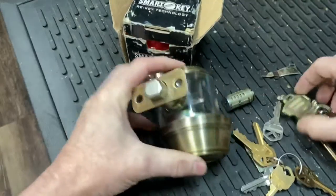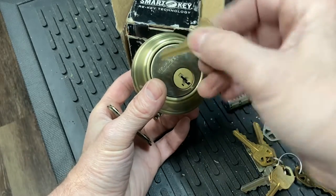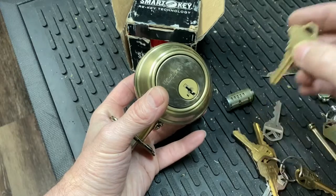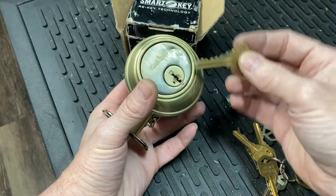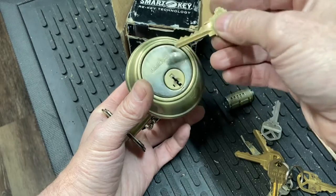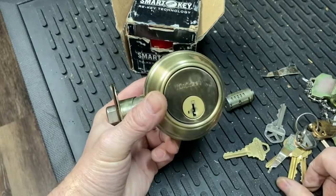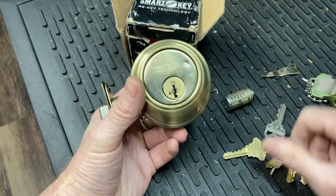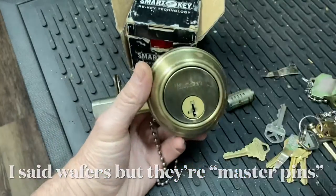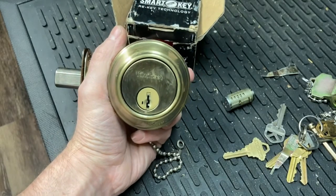I just wanted to kind of throw that out there — it's a possibility. For me it's a key checker, so I can cut keys and duplicate them. Once I program that, it's like five to ten seconds and I can just check all my keys on there. If I have to duplicate 20 keys off one key, I can go ahead and check every one of them right there instead of walking around each door. These are pretty accurate — I think two to three thousandths max is what it'll allow, plus or minus. Just kind of a cool idea. If you just want one deadbolt with two different keyways, you can do a key check for a Kwikset or a SC1 Schlage. Well there you go — that's an easy way to do it. Thanks for watching.